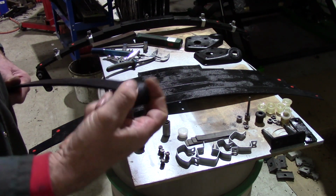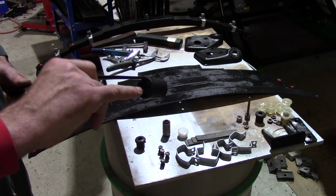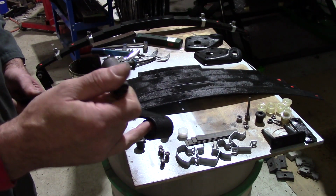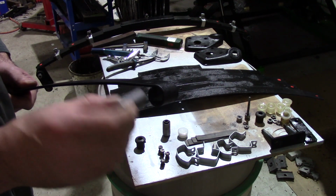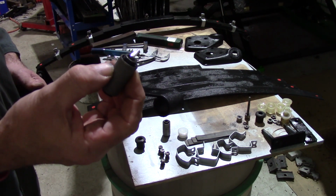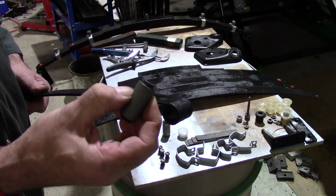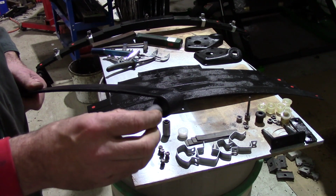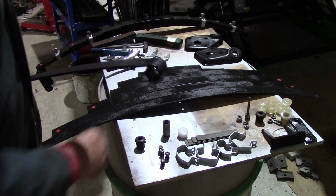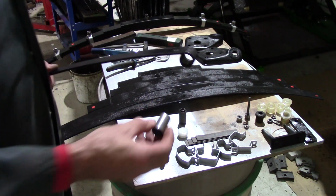The reason it's sloppy like that is simply that I've sandblasted these spring components and removed all of the rust that was in there. So the old ones were actually held in just with rust, and I've proved that by measuring the diameter of that, cleaning one of the old ones up, measuring the diameter, and it's exactly the same. So these are the correct ones, it's just that the springs are rusted away. So what to do about it? New springs? Nah, we don't need that.